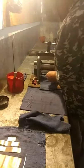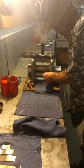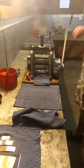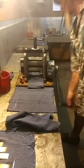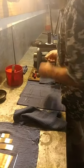So what are you thinking — like 20, 30 times per piece to get it down to the size you want? Hundreds. Hundreds of passes. You roll the straps a little bit, then anneal it, clean it, and roll it out a little more. You push too fast, it gets cracked. So if it's worth having, it's worth taking your time with.